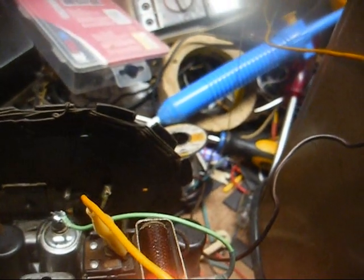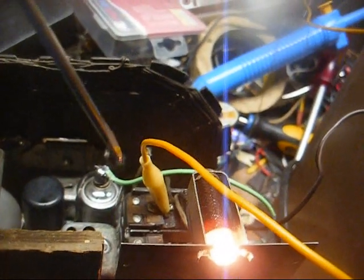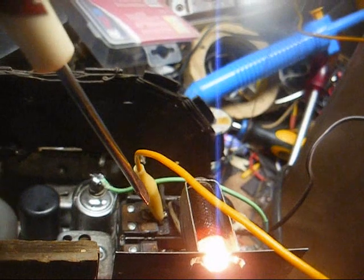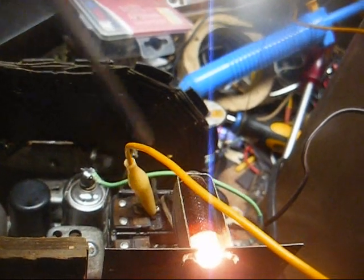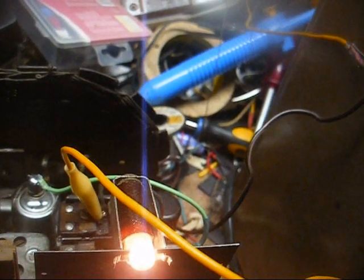Now, I could have done it that way and peaked out the second IF transformer and then moved my signal generator lead back to the grid of the oscillator and mixer tube and peaked out the first transformer, but generally the only time you really need to do it that way is if it's really out of whack, as in somebody took a screwdriver and tightened everything down.